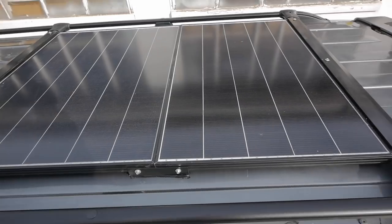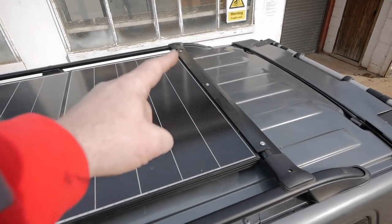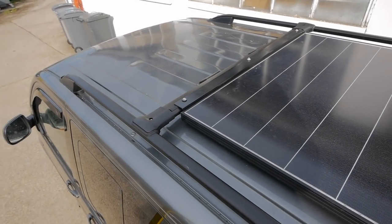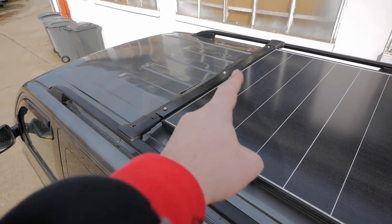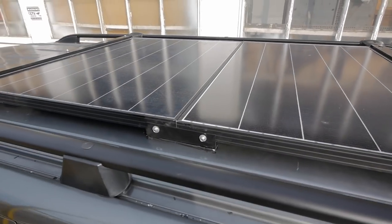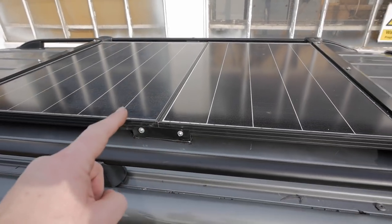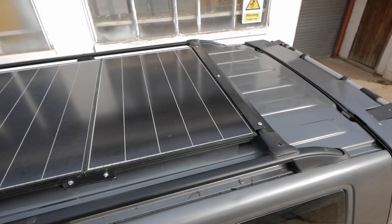The panel is bolted down — I've used some self-drilling tek screws to hold those down. What I'll do over the next few days is change those for stainless steel. I've also added a little angle bracket on the side and sika-flexed it down to the roof just to support the centres. That's about the job complete — I think it looks good. That's everything back together and all working. I'm really impressed — we've got nearly four amps charge now, even with all these lights on. Don't forget to like the video if you liked it, subscribe if you've not subscribed already, and I'll catch you guys later in the next video. Cheers!